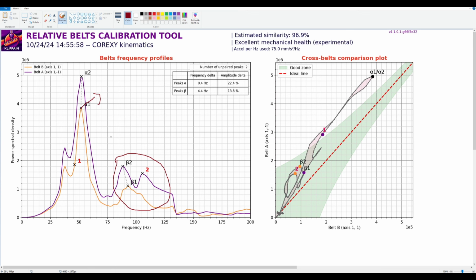If it stays the same, or if it moves up or whatever, we want to see if these guys here will calm down, right? If they go up like this, then it's best to start over, because one side, probably the A side, has too much tension in it already. If you see something like this happen, where this guy goes up after you've tightened it a quarter of a turn, well, that's telling you that both your belts are probably tensioned too much.